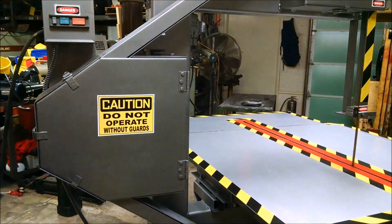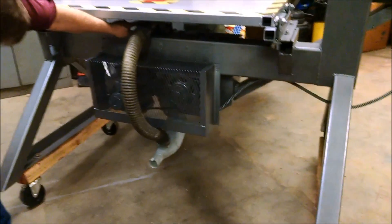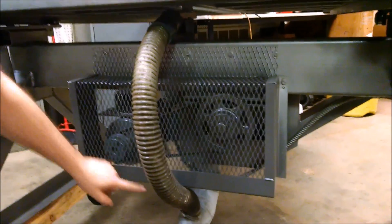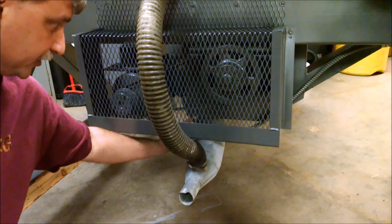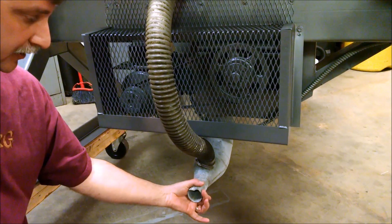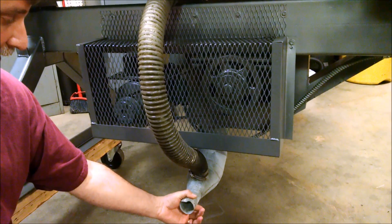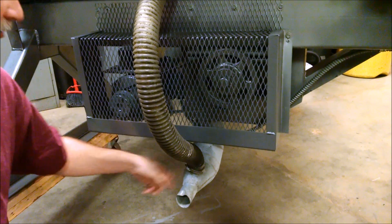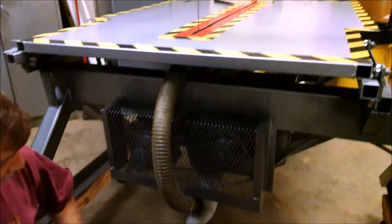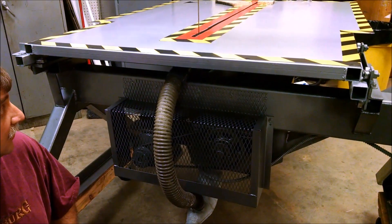Just push the button to stop it. It has a built-in dust collection system that sucks the dust off of the saw blade itself, then comes down and joins a main chute which comes off the bottom inside of the blade. You would attach your dust collection system to this outlet and it would suck from both the underside of the wheel and the top side of the blade. You need at least a one horsepower dust collector to give enough vacuum.